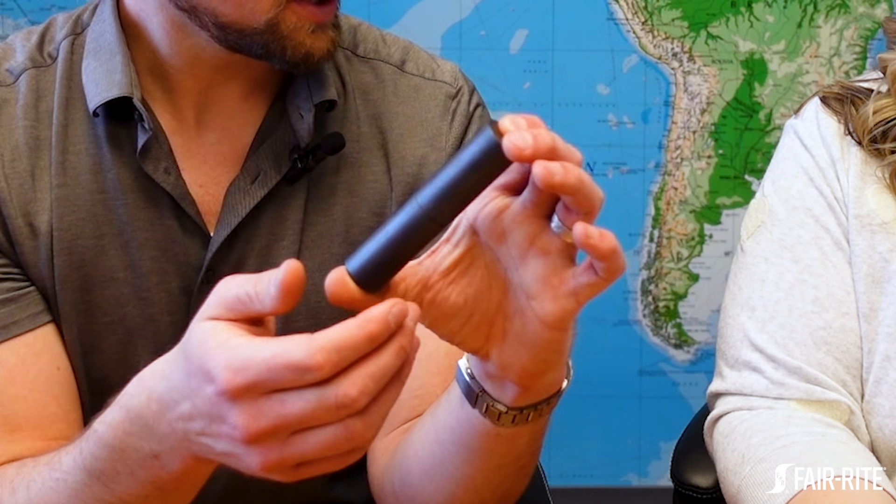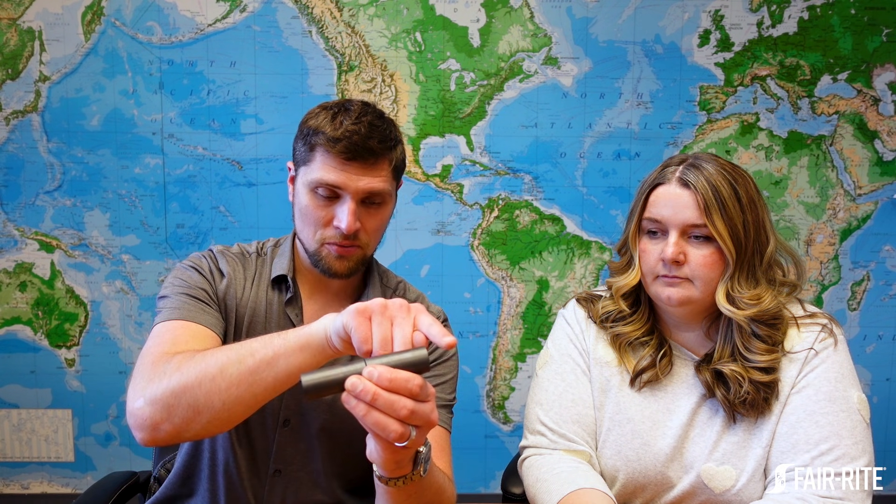You stack them together end to end and wind around the whole outer diameter. Because the magnetic path length on a rod goes through the center of the core — the magnetic field emanates out of either end and back into the other — most of your magnetic path length in a solenoidally wound rod core is going to be air anyway. So having this tiny little crack between the core halves isn't going to make a huge difference, whereas a break in a toroid made of multiple arc segments would be very significant.